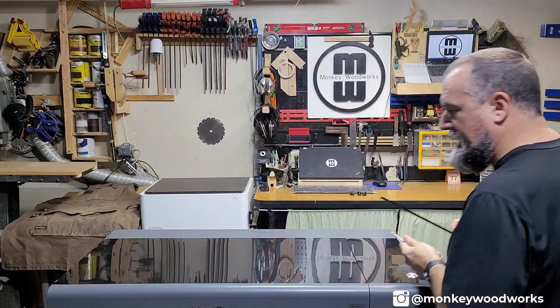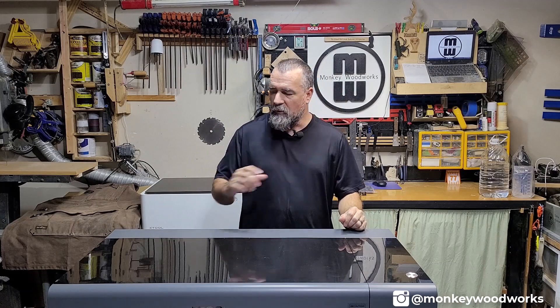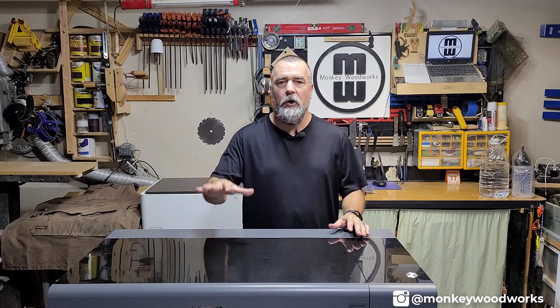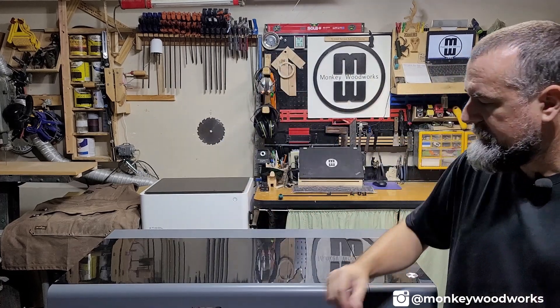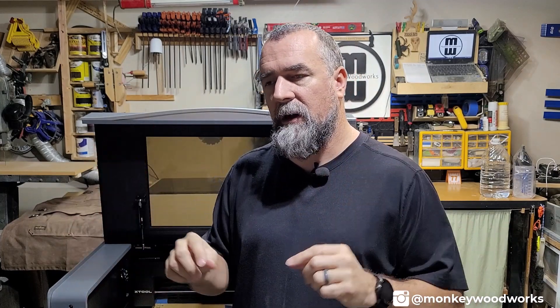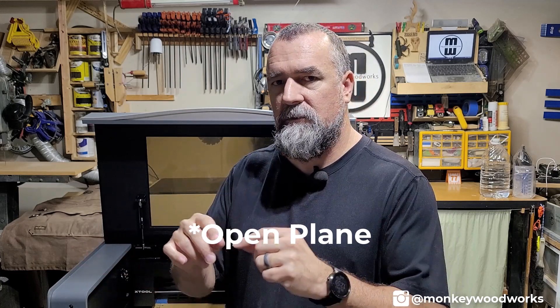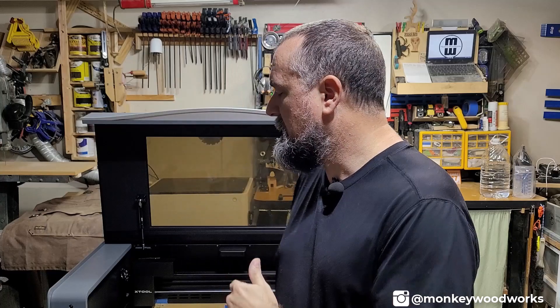Now I'm going to take the camera off my stand — it's going to be a bit shaky, so stick with me as we walk around and take a look at it. Before I do that, I'm going to open the lid and show you what the working area looks like. I did a little test with a piece of cardboard — I put it in there and set XCS to laser flat, placed a rectangle at the full extents, and cut it. Then I switched to open plane, placed the rectangle at the extents, and cut it again. That way I can see exactly what the working area is for each mode.